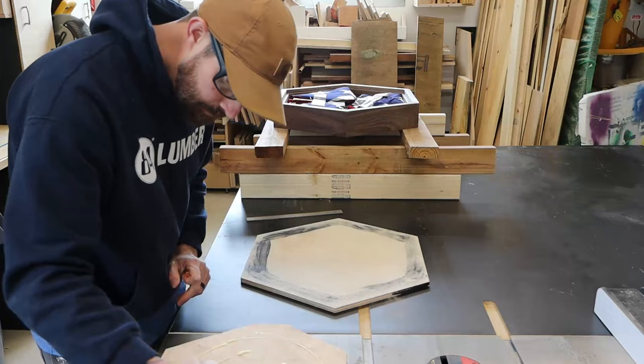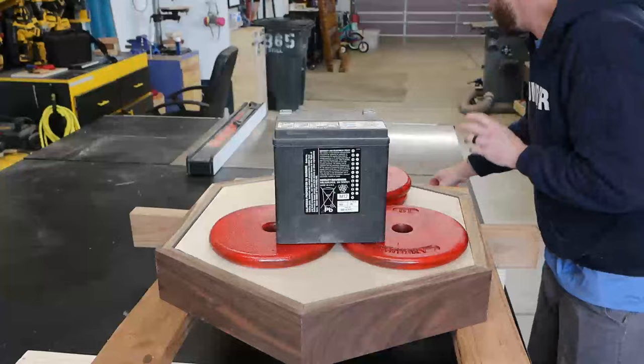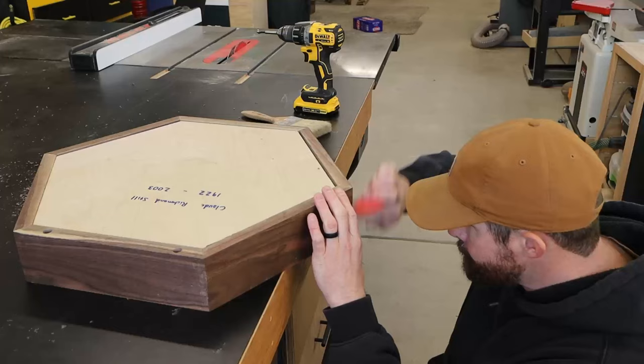A three-quarter inch piece of plywood will be perfect, so I trimmed the edges and glued that to the inside of the back lid. With a very careful glue seam around the rabbet and some pressure to hold it down, she's all sealed up. Last thing before calling this project done is to drill some mounting holes, touch up the glue seams with some sanding, and reapply finish to those sanded areas. Here it is — pretty unique, and much less dusty, and much more fitting of a home for Pop Pop's flag. Thanks for watching, see you next week.